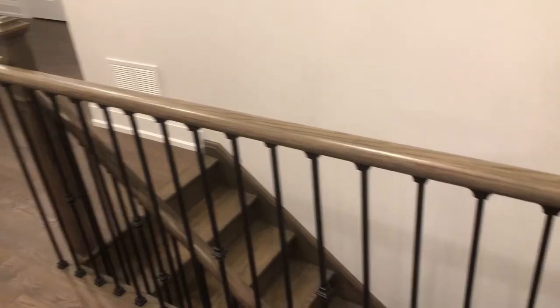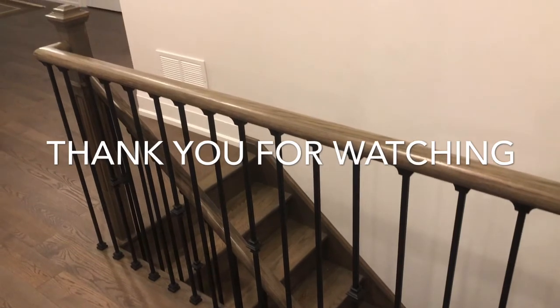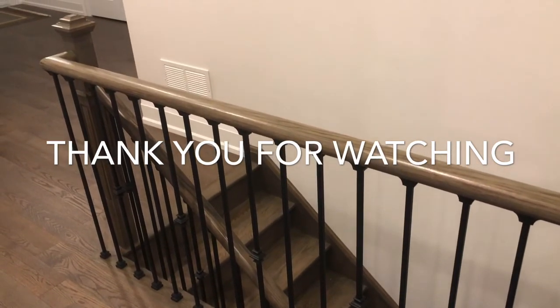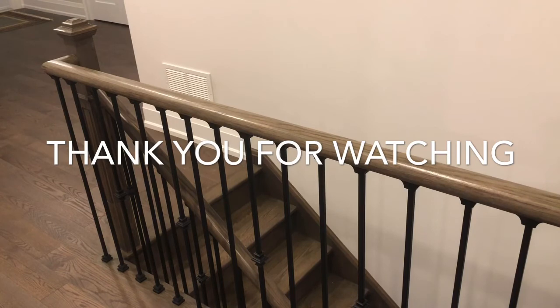find out where the railing is, pre-drill, drill from the other side, brace everything, pre-drill, lots of pre-drilling, and brace everything with a new piece of wood, which should have been there from the beginning from the builder or the framer of the house, which it wasn't. So I just had to go back in time, do their work for them. Even the back framer could have done it, but nobody did. Big oversight. So anyways, this kind of thing, the railing guy could have used a longer screw, and it would have avoided me going in to fix this.